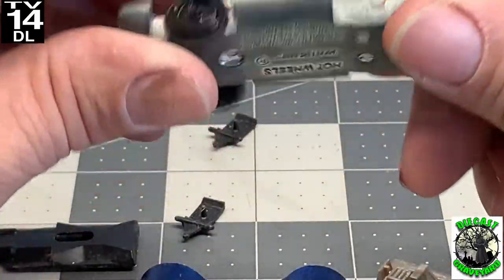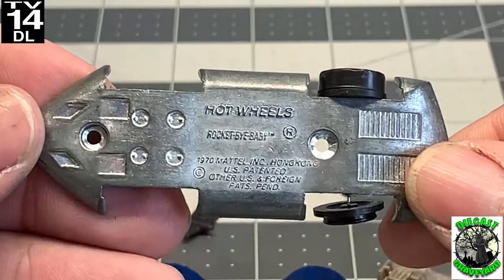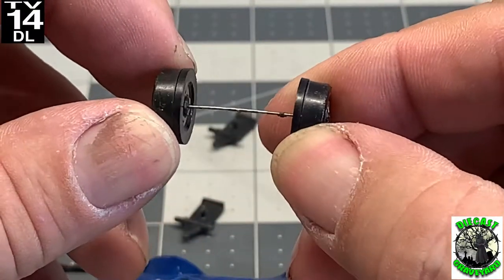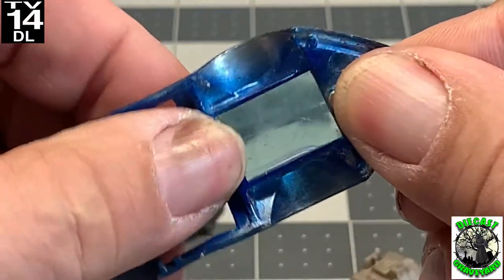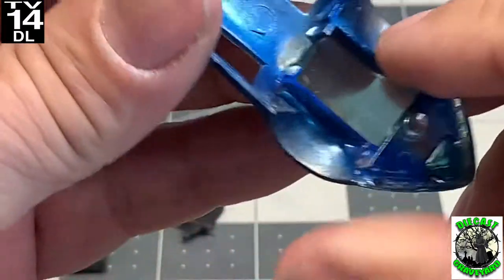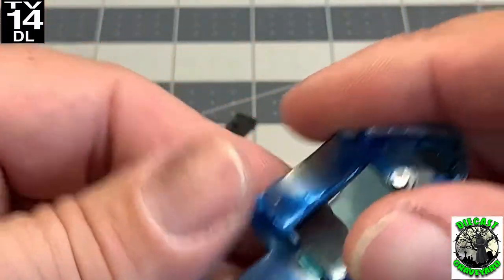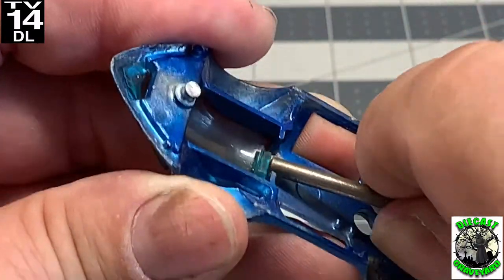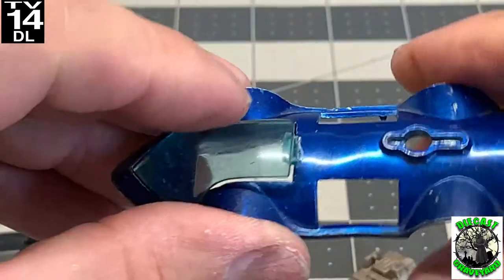Here's the base. The part that holds the wheels together is all dry-rotted and incredibly brittle, so we're going to have to fix the wheels one way or another. The base will have to be polished, and look how bent the axles are — we're going to try and save those. The body itself, we're going to have to pop out this windshield. It may take a little more effort but we'll get that taken care of. Now one thing I've noticed about these particular castings is that the body on these cars during this time period is incredibly brittle.